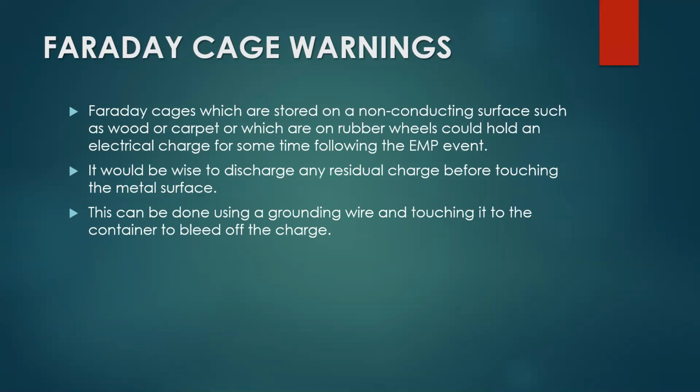If you've ever worked with televisions, the old-time tubes, the CRTs, what's the first thing you do when you open up the back of the case? You want to ground out that flyback discharge. Yes, you want to ground out that capacitor because there's, I don't know how many thousands of volts there, but it's in the tens of thousands. And you sacrifice your screwdriver, and that's why they use very large diameter screwdrivers, because there's a lot of current that goes through, and the same thing will happen to you if you touch a metallic Faraday cage and you're grounded, you're going to feel it.